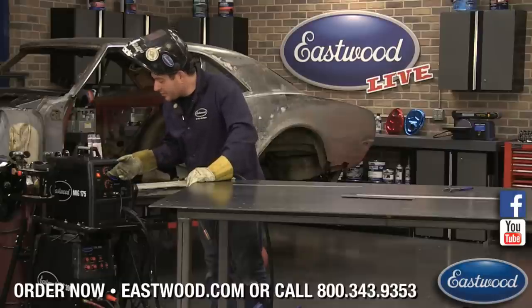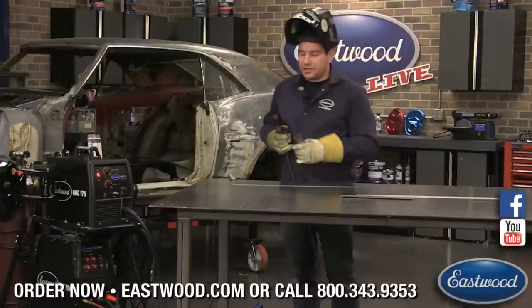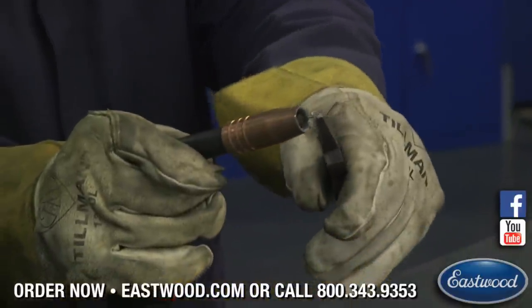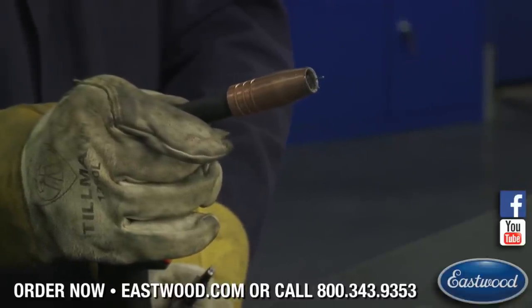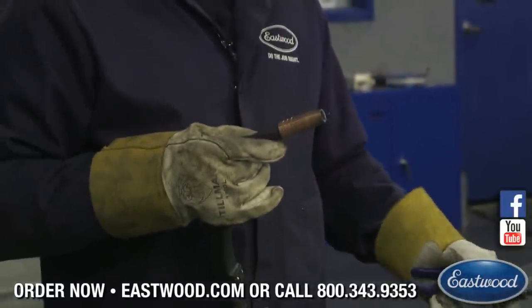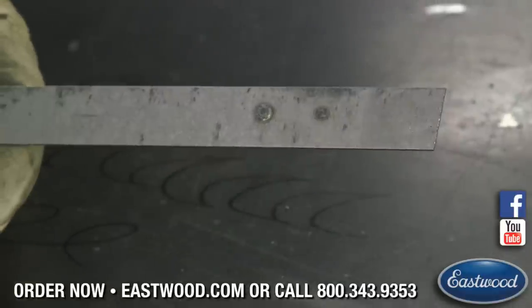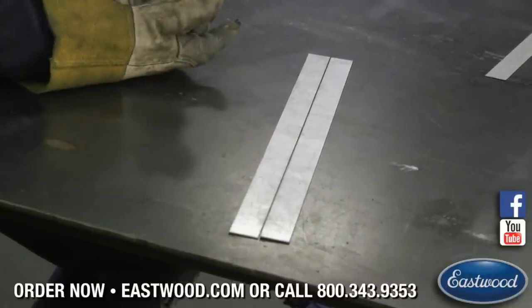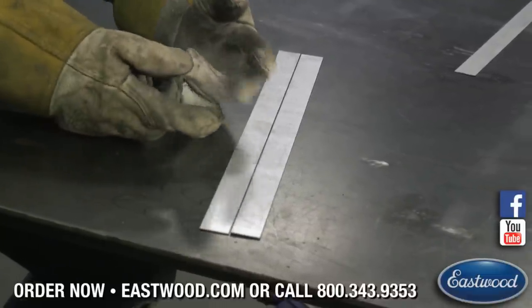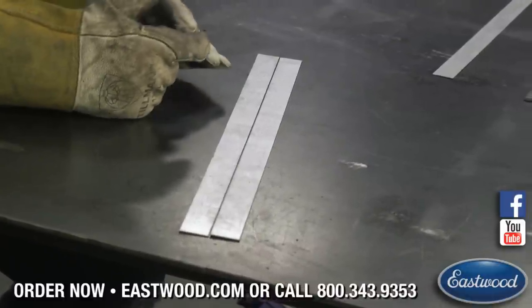So I've turned the settings way out of whack to show that. When you're doing sheet metal, there gets to be a little ball on the end of the wire every time you do a weld — that ball is probably twice the diameter of the wire coming out of there. To initiate the next spot or stitch weld, that ball makes it difficult to get 100% penetration. It's tricky, especially for beginners, because making that gap can cause blow-through. It does work, but it's kind of tricky and I don't particularly like it.